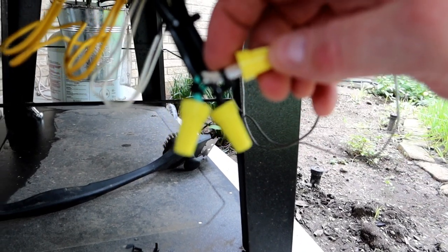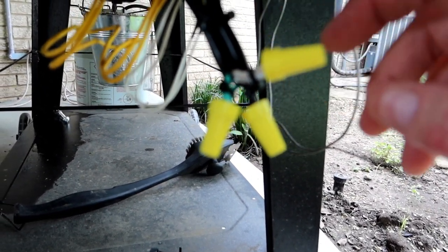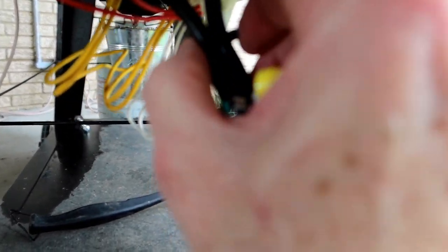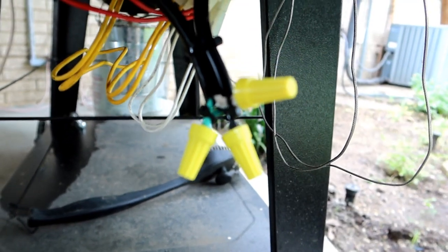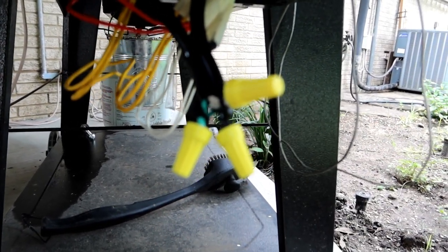What I've done is put an individual cable tie around each of the individual wires to hold them together after attaching the wire nut. I also attached another one up here to provide additional strain relief. That should keep everything together and prevent any strain or stress from pulling on the cable from actually breaking our connection. Now I just need to wrap this back up into the underside, reattach the strain relief to the back, and we should be good to go.